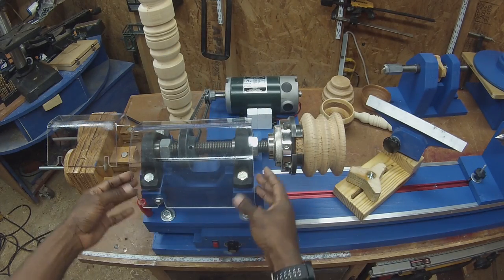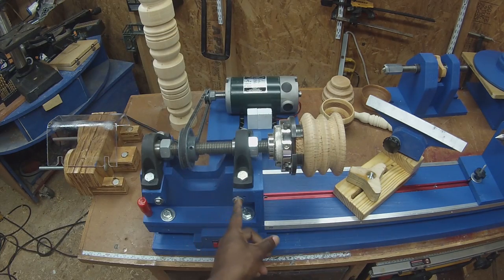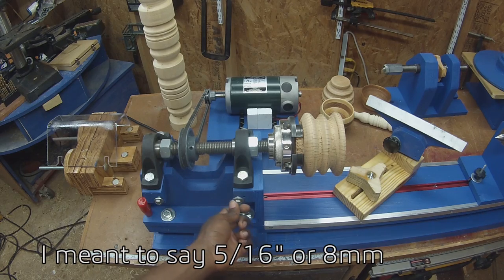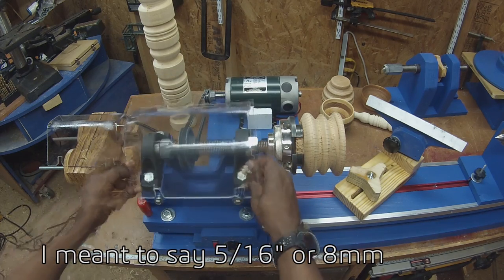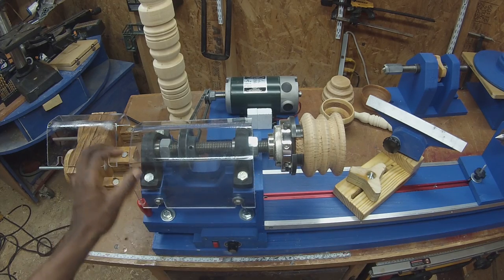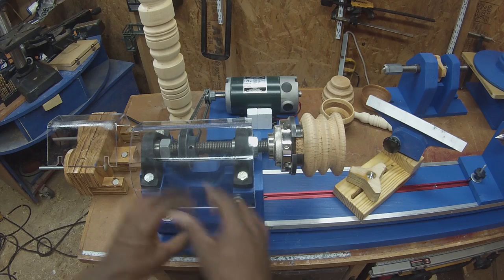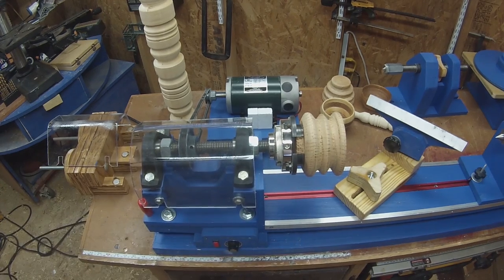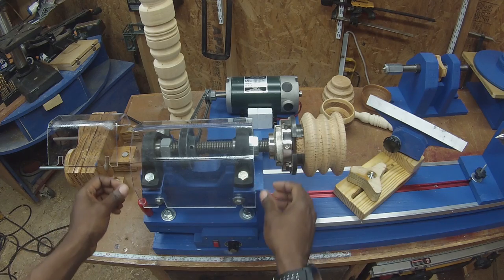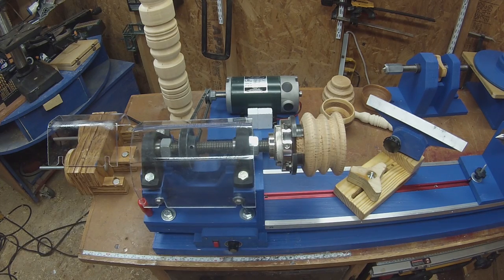The guard is made in such a way that I can slip it off. These are just two tapped holes and some five-eighths bolts here. That gap is just tight enough so we can slip it back on. When the lathe is running, I've turned it all the way up to full speed and it doesn't vibrate or anything. I found just the right amount of snugness where you have to work it back in there, but it doesn't vibrate or make any noise when you're using the lathe.